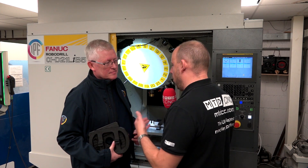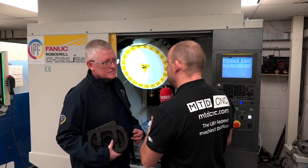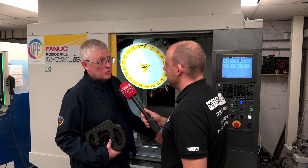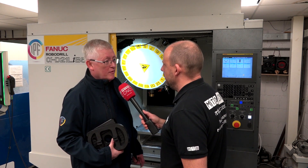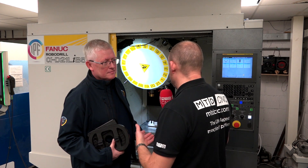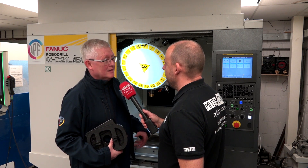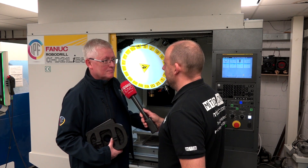What about coolant on these materials? Sometimes people cut the types of materials you do dry, but I notice it is wet in here. It gets very wet in there — the coolant is actually giving us a far better surface finish and it's easy to wash off afterwards. We've got high pressure coolant and through-spindle coolant as well. It keeps the machine clean and stops a lot of clogging of contaminant material. Parts are coming off burr-free, nice and clean — it really is the best way for us to go.